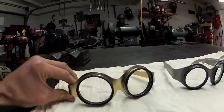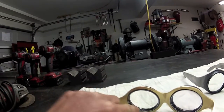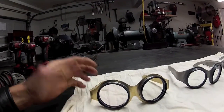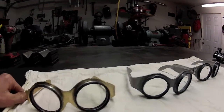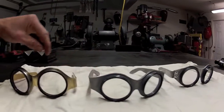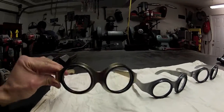If you're thinking, what about if the glass breaks — what if that's going to hit you in the eye? Well, that's why I'm going to put a polycarbonate thin sheet about this diameter inside, so that will protect my eyes from shattered glass. It's unlikely, but if I'm grinding something and a big chunk of metal comes off, there's a possibility it could crack the glass. If I'm doing something that heavy duty, I'll wear my full face protective shield. But these are for everyday machining on a lathe or light mill work — just light duty stuff.